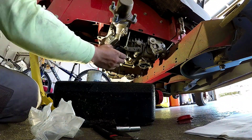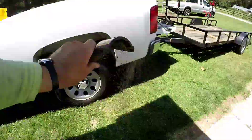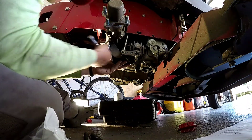Now I'm showing you how to put it on. Making sure the rim is perfectly clean. Put a little oil on it. Put it hand tight and then wait a second, then grip it down as tight as you can with your hand. Then put the cover back on.